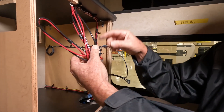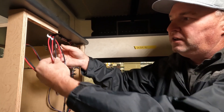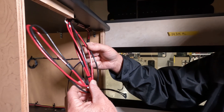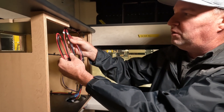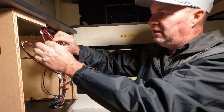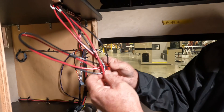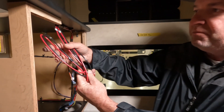You'll have labels on the wires: rear wall plug going back to the battery, and roof plug. You'll need a solar charge controller — whatever brand you're choosing, such as Overland Solar, Victron, or others. Wiring from the roof panel goes into the solar controller positive and negative. For a portable panel using the rear wall plug, put that positive and negative into the charge controller as well. The battery port on the controller connects back to the battery bank. So there are three sets: roof, rear wall, and battery.